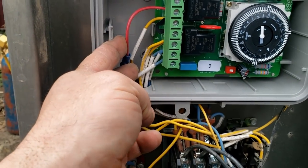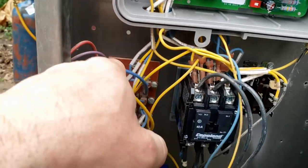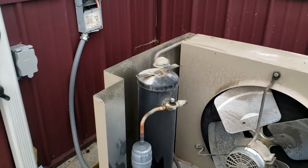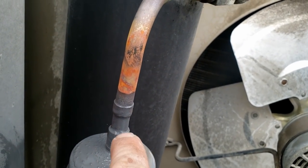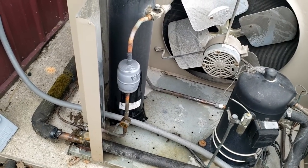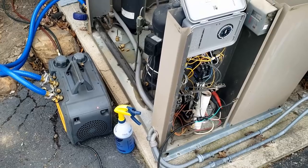Only had to extend one wire for number three, which worked out pretty okay. The rest of the contactors, switches, and relays seem to be all right. Just got to get a couple of wire ties in there. Got the filter dryer on — went with a sweat dryer, gave it a little squirt of gray paint. Built a little nipple to get into the dryer because of the area I had to cut out. That's where the swage tool comes in really handy.